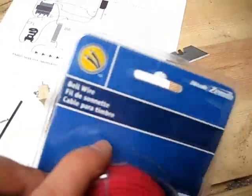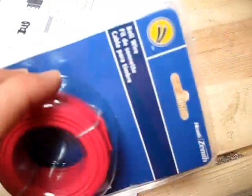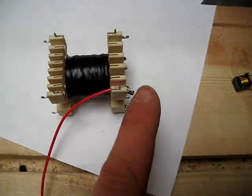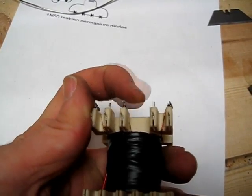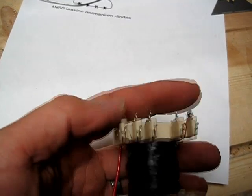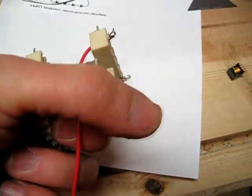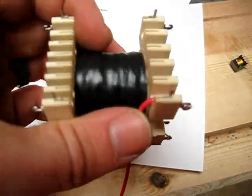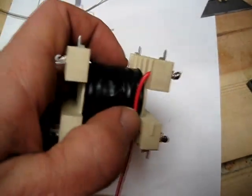What I'm going to use next is this — they're calling it bell wire. This is just a 20 gauge wire with a nice insulating covering on it. I've attached the wire to this lead here — the opposite side from where we started with the fine wires. We've got our high voltage out, the three wires that come into here form a trigger coil, and this exiting wire over here. On this side we're going to start winding in the opposite direction — not winding down but winding up. The high voltage wire started winding down; this 20 gauge wire we're going to be winding up.